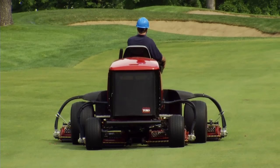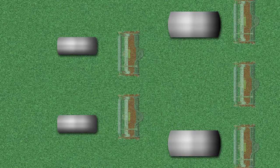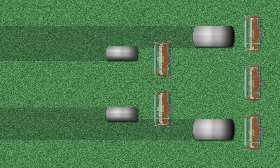The challenge is making everything work in concert to provide the cleanest possible aftercut appearance. One of the more subtle examples of this thinking is the tire alignment of the RM5010 traction units. The rear tires are slightly but purposely moved out to create a small overlap with the front tires. The result: in the event tire tracks do show on the turf, you'll see only two instead of four. That's attention to detail. While this design element isn't adjustable, there are a number of adjustments built into the traction unit that can be tuned to improve your aftercut appearance based on turf conditions.